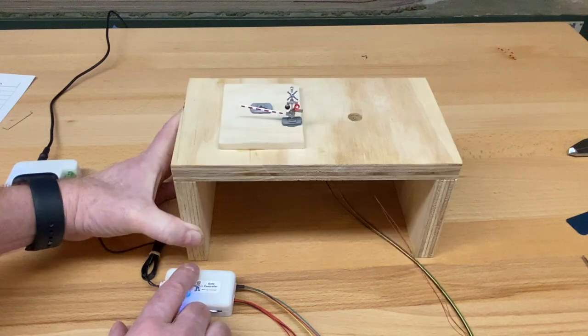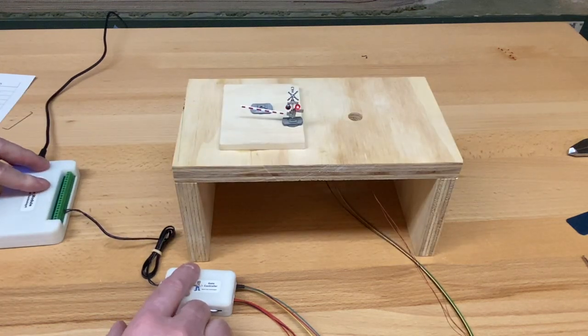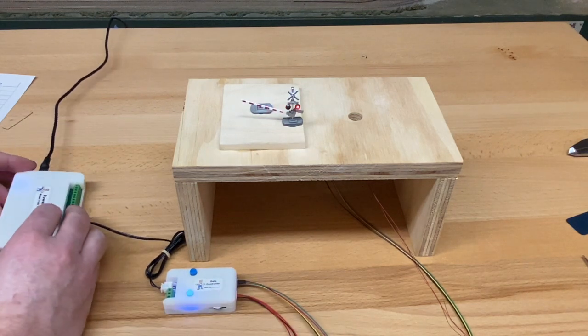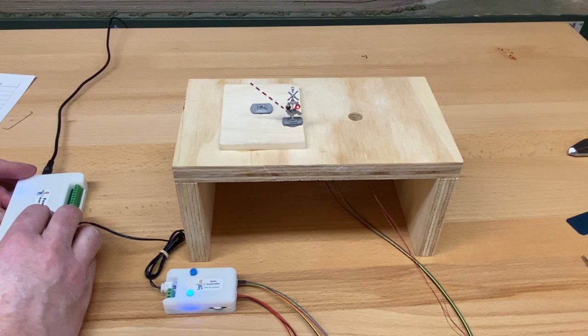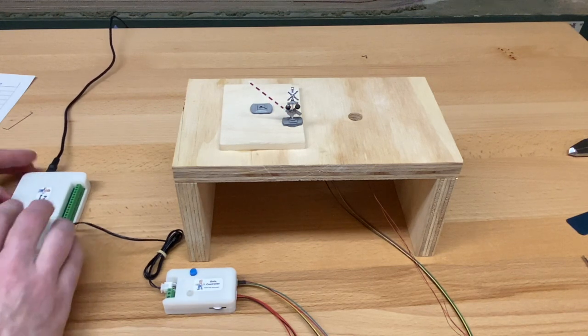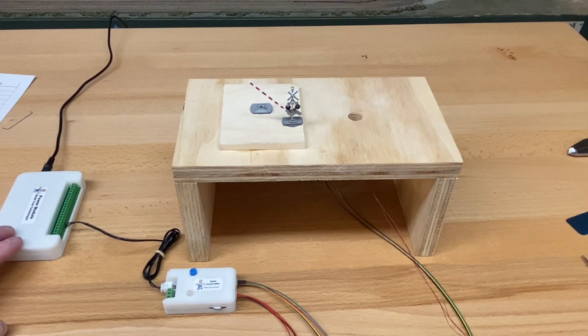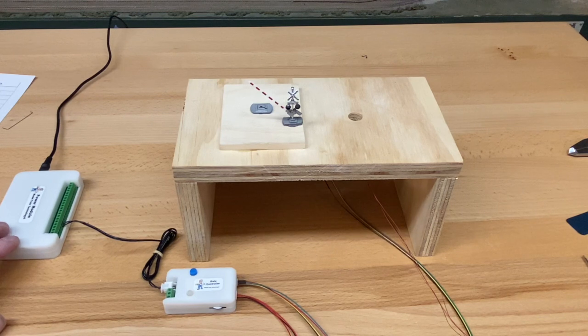Now, I'm going to start it in the back up into the up position. Just press the button twice, and it's going. And I'm going to kill the power. Now, the motor does not remember where the stop top position is. It just remembers it based on when it was powered up. So you want to have all your gates always in the up position when you turn off the power. Don't do it while they're in motion.